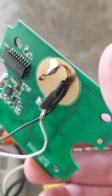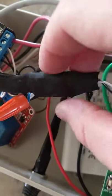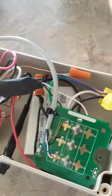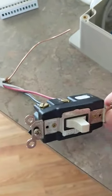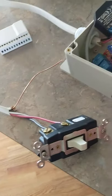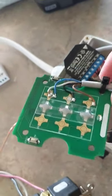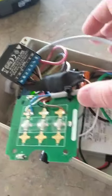This normally does have a battery in the back of it, but I went ahead and hardware hacked that too, because I want to put this in place and forget about it. I actually wired it into this little converter from 24 volt to 3 volt. So this whole box is designed to let me use this in addition to my voice to control my RF blinds — my roller blinds that are RF controlled. I have my regular RF remote, which would be the traditional way. The housing's gone from this, but you'd basically mount this on a wall. I just didn't like how that looked — it looked kinda nasty.